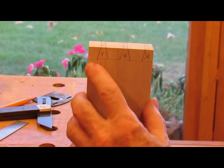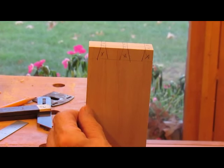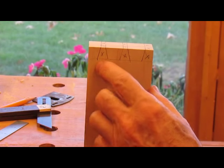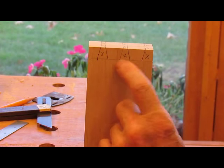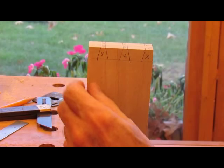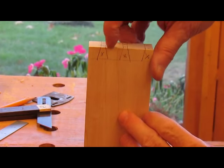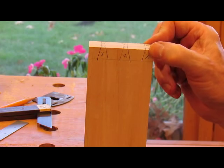It's just arbitrary. This is the bottom here, and you have a groove in there for the bottom to slide in from the back. Usually I try to leave myself a half-inch here because you have about a quarter-inch underneath the drawer and then a quarter-inch bottom for the drawer. In this particular case it's an awfully small drawer, so I only have three-eighths of an inch — so I'm either going to make the bottoms thinner or move them closer to the bottom edge. These are three-quarters of an inch, and this is three-sixteenths at the top, and whatever is left over will be chopped out — so that's the top.